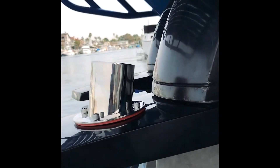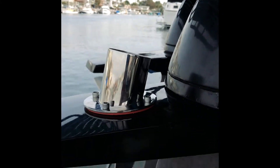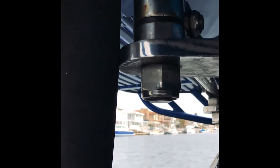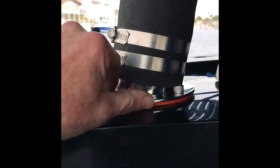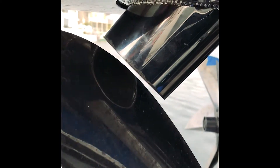We're getting the top piece mounted. It takes four Allen head screws, a couple of lock nuts, and some washers. We've got one of them completely installed. You can see the tube up here just barely touching at the top. I could twist it a little so it doesn't touch, but it has a slight bend and gives a little support — it's not flapping around. With the two hose clamps on and the upper unit mounted, you can see right here the prop is passing by perfectly — exactly a quarter inch clearance.